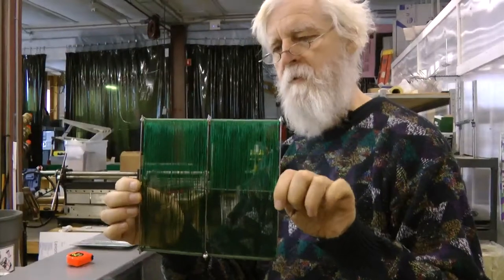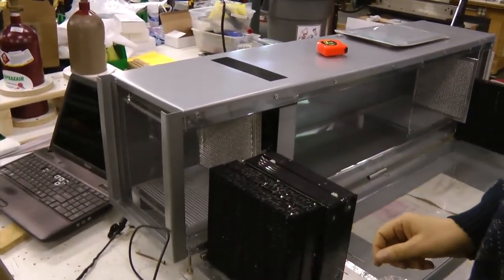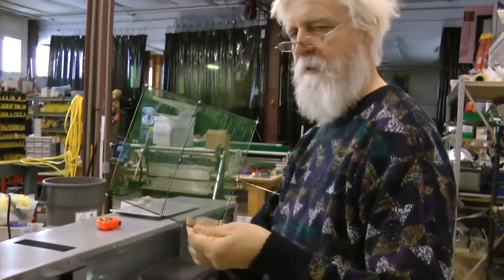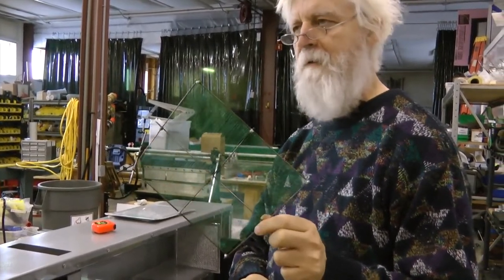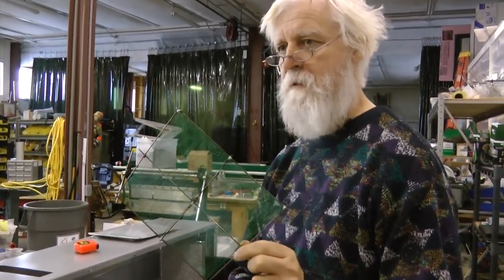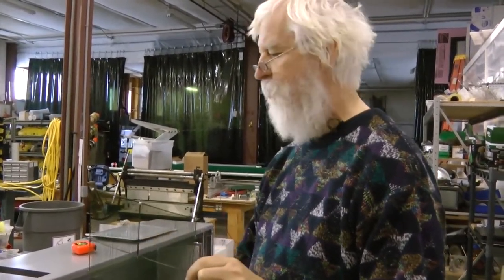So this is really super smooth. The air flows through that and heats very evenly. The next bit is the air comes in and flows through this sensor. This is a sensor that's also very smooth — it's a 150-foot-long RTD. Most RTD sensors are about the size of a pinhead; this one's 150 feet long, so it'll sense every part of the air.